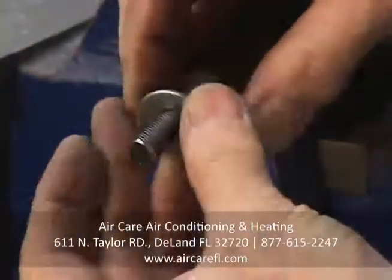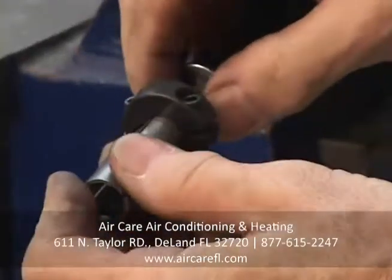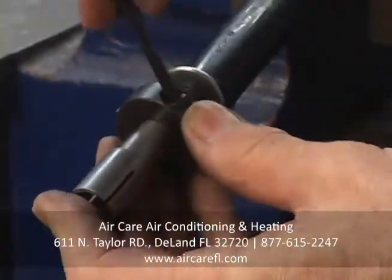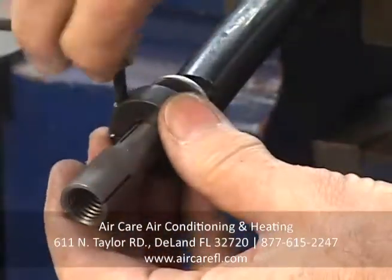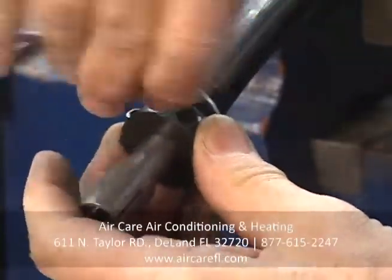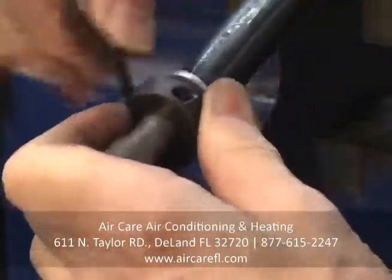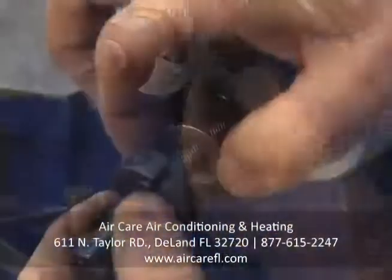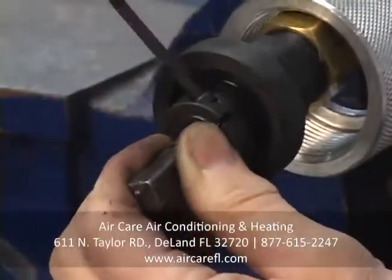Once the cable core is cooled, install the thrust washer onto the deburred core, and then the repair end can be fitted over the cable core end. The clamping collar should be positioned on the repair end, and the 2 Allen head cap screws must be alternately tightened to keep the gap even on either side of the clamping collar. The collar clamp must be tight, but do not over-tighten the screws or you may strip the threads. The repair is complete and the cable is ready for service. As you can see here, the same procedure applies to the machine end repair kit installation.